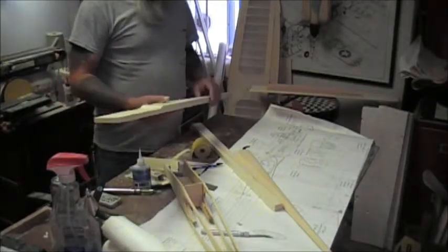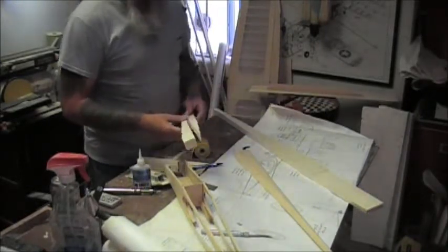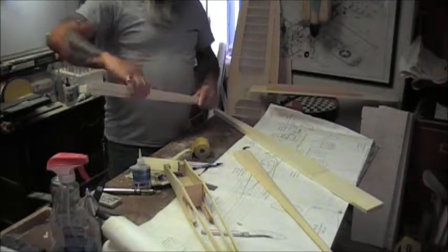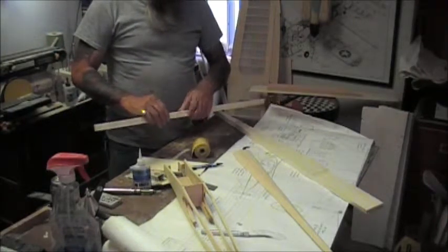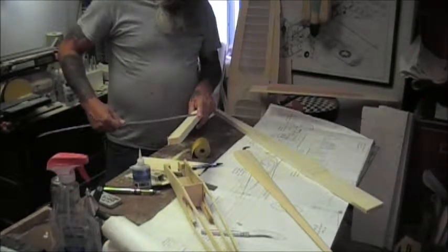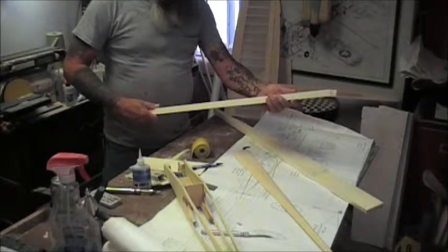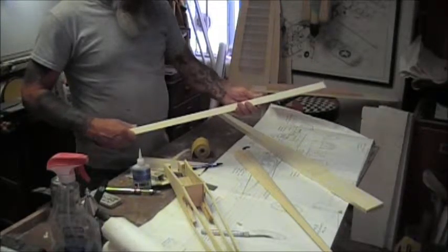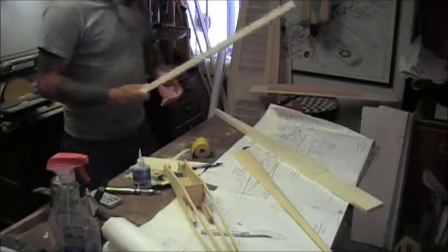It took five minutes, sawed the material off. We got kind of a baseball bat shape, but that is not what I am going to talk about. I am going to talk about the material that actually came off this block. Because the wood is so good, I am going to take these two pieces, laminate them together, and take them on my table saw to square up the cuts. We will have a piece of wood that is super light - an inch and a quarter wide by however long this is. Instead of throwing it out, we can go ahead and laminate these two pieces together and use it somewhere else, because I see no reason why this wouldn't be a good piece of wood.